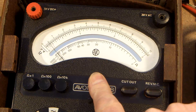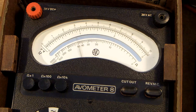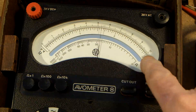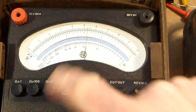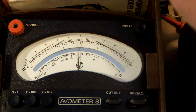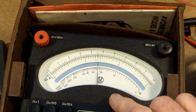I've got this meter connected across the cell, and now I'm just going to put 30 volts onto the cell — so that's full scale deflection there. I've taken that off, and you can see the voltage there. I'll change the meter scale — that's 10 volts, that's three volts now. I'm on the three volt range, three volts DC. You'll see that the cell is holding a charge — so that's one and a half volts. I was trying to lower the voltage on the power supply, and as I was turning the volts down, I noticed that the current reading was going negative.